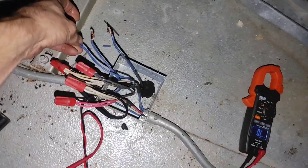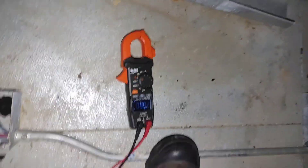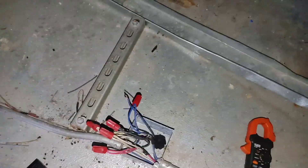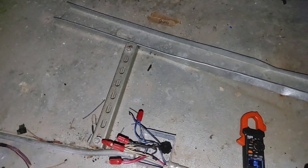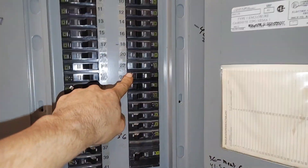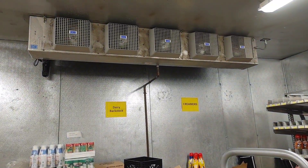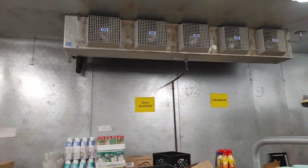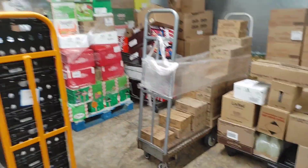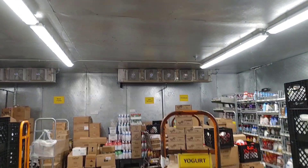I'm going to reconnect the right-side evaporator only, turn it back on, and see if it trips or not. Connected back together - the right evaporator - and it's pulling 7 ohms across all the motors. Going to go turn it on: if it trips I was wrong, if it stays on and the fans on the right turn on, I was right. And I was right. So there's a problem in the left evaporator. At least it's time and a half. I've got it back on and cooling somewhat.